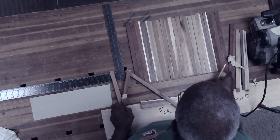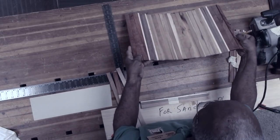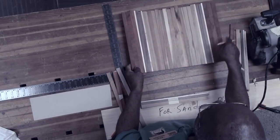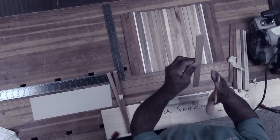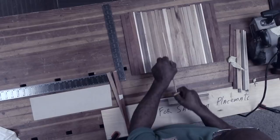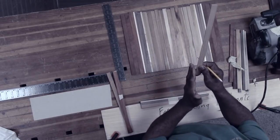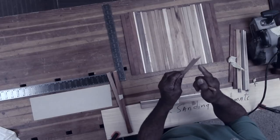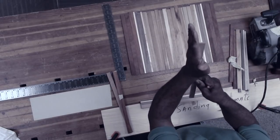This is not a finished placemat - I'm not going to use it. I put this together so I can show you some things. These have obvious cracks. You have one piece that's curved this way. But once it's curved this way, if you sand it straight, you also have the other end that's curved and it's going to create a different crack. So this will create a crack in the center, and this will create a crack on each end.